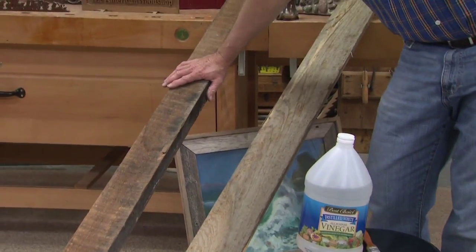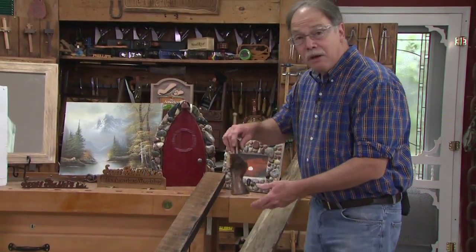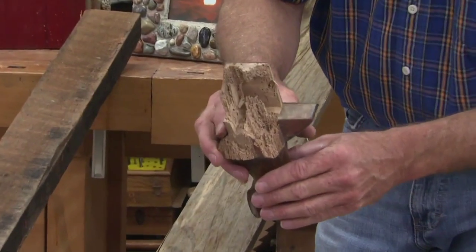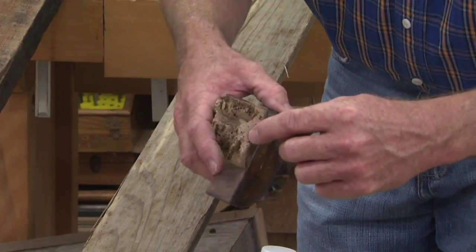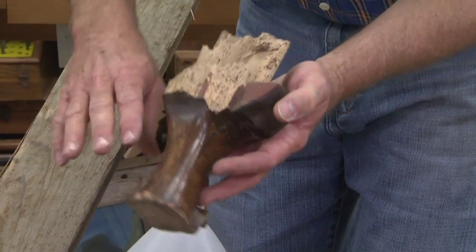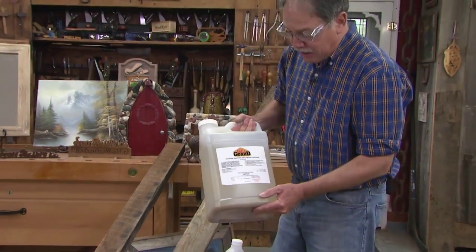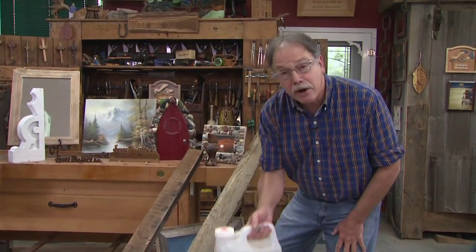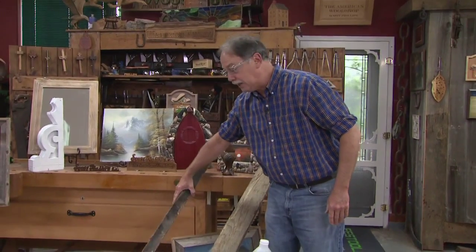But let's say you recycle some southern yellow pine that's 170 years old — beautiful stuff from Joe Drapp. It did have a few of these in it. This is called Powder Post Beetle. It starts out life as a tiny little hole on the outside of the wood, but it will totally destroy the wood over the course of years and can stay active for years. So how do you treat that? You use this — it's called Shell Guard. It's a borate salt. Follow the instructions 50-50 with lukewarm water, brush it on, let it cure, and I like to let it dry for at least two weeks. That will take care of the bugs.